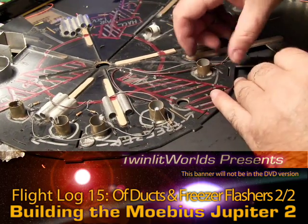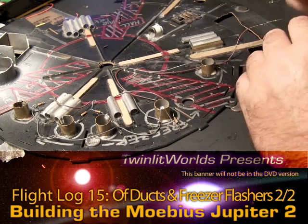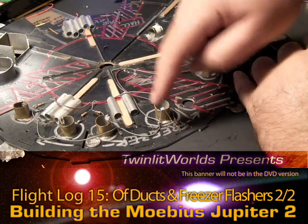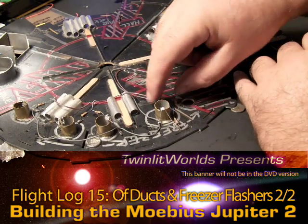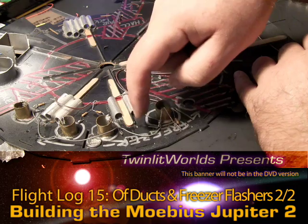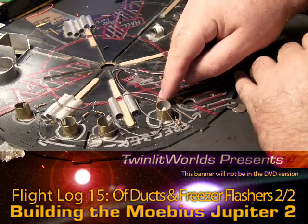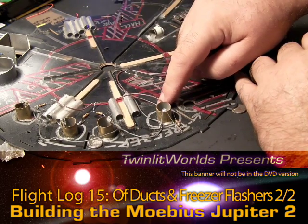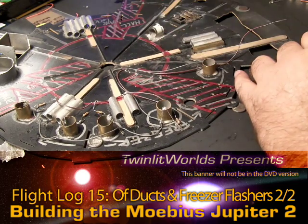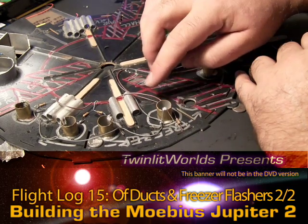These wires look just long enough to reach to this one here. So what I will most likely do is when I install this RGB, I'll run it off of these legs here and just make a separate connection and be real particular. I can go negative straight to this joint here, and the negative I have to come all the way around here, and the positive I can go on that joint right there. That's definitely a delicate one to keep an eye out for. So I'll even glue that in place a little more right now. Want to keep that out of trouble.